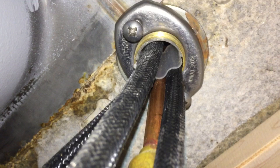That washer actually has two little holes on it that accept those two screws so that you can actually screw into that top washer. So when you're trying to assemble this together, the reason why you want those two things, the big oblong washer and that top washer with the screw holes in it, is that you're going to use the oblong washer and spin it with your hand to coarsely tighten up everything. And then once you get it roughly tightened up, but still to the point where you can kind of finely tune the position of the faucet up top, you're going to hold that faucet in place right where you want it, and then you're going to use the screws to tighten the fixture together and hold it onto that countertop.